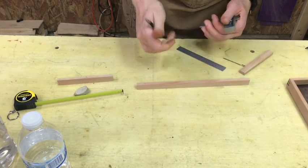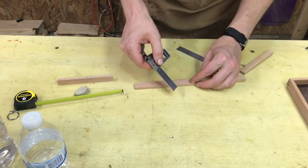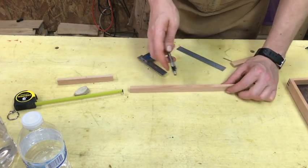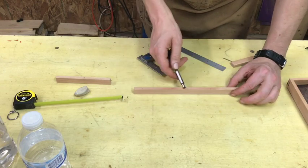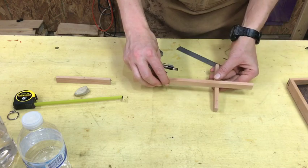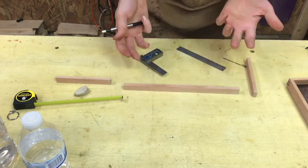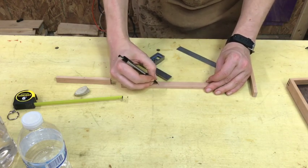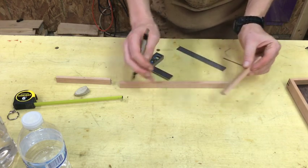and so on. Okay, once we've got our marks marked out here, we're just going to take a small square and we're going to copy those on all 3 sides. You're going to also decide which side you want facing up. I happen to like this side. So that means for me, aesthetically, I think the smaller ones going under and the main one across going over is what aesthetically looks best. Which means we'll be cutting out the bottom of the over piece and the top of the under piece.